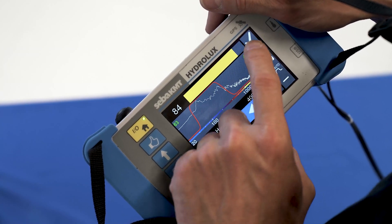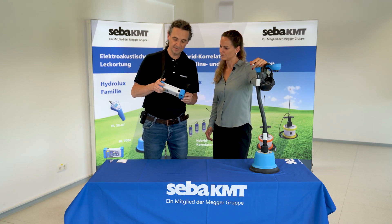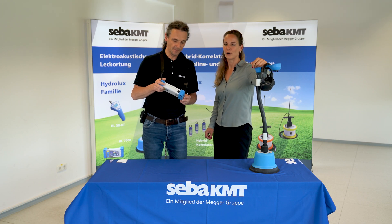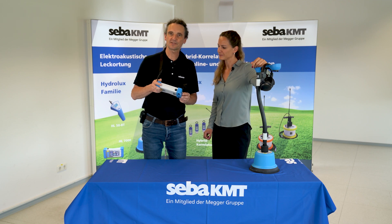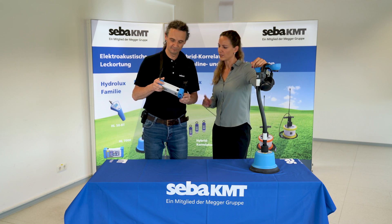For steel, I would choose a higher frequency range, let's say starting from 300, 350 Hz and up. For plastic pipes, the typical frequency is usually lower. I would start below 150 Hz. The upper limit frequency is probably rarely above 300, 350 Hz.